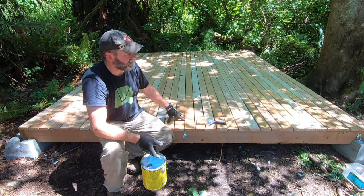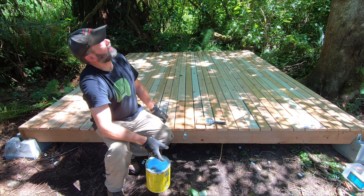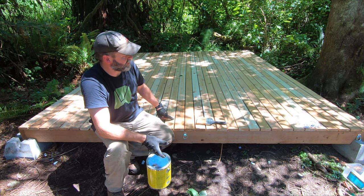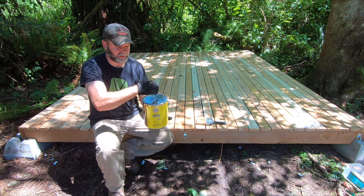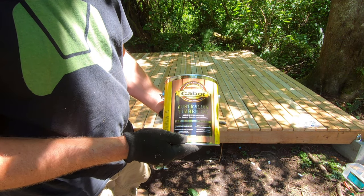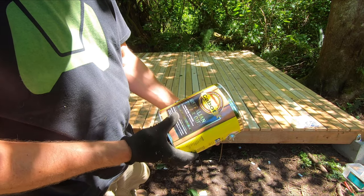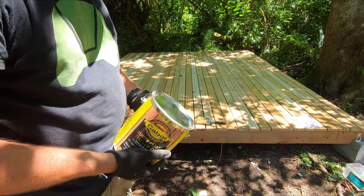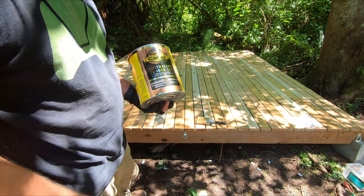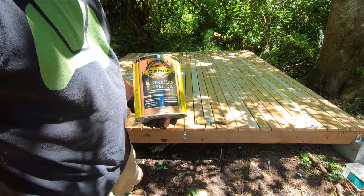I want to put some kind of sealant stain down on this wood so it'll last longer. Here in the Northwest it rains all winter, especially up here in the woods — it just drips constantly — so this wood's not going to last too long without something. I picked up Cabot Australian Timber Oil Natural from the hardware store. Not a sponsor — the gal at the store said this is the best, so we'll see. My farm helper is going to start applying this while I finish up the last couple of D-rings, and then I'll jump in and help him.